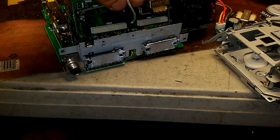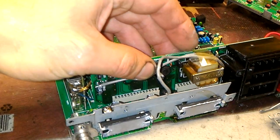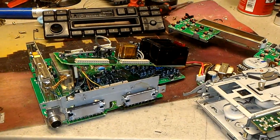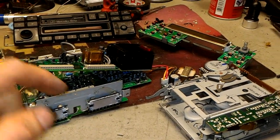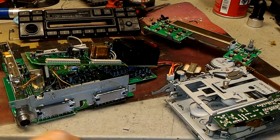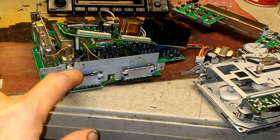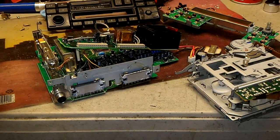Now, what I can try to do is, if I'm able to with one hand, I probably won't be able to, but I'm going to make another video later with a demonstration of this piece working, because I actually put it together on the bench without the case, and I just tested this chip, and it works along with the capacitors on the left side channel. Now I have to go onto the right side channel and do those, because if this one failed, this one is soon to fail like the left channel, so we don't want that to happen.